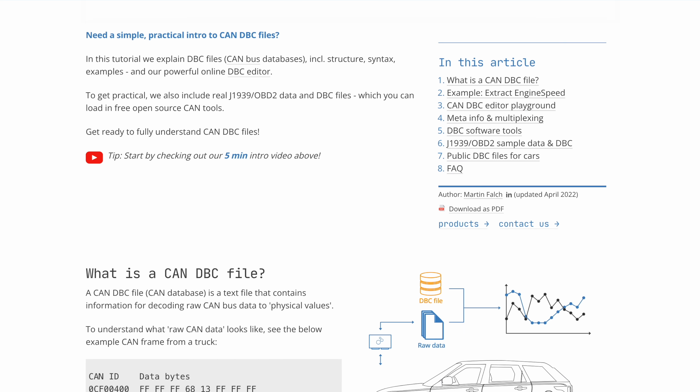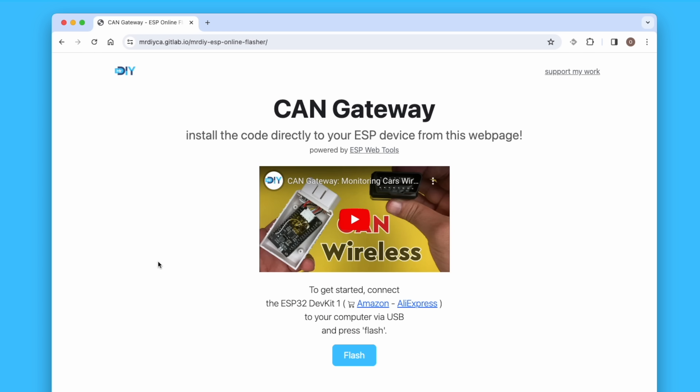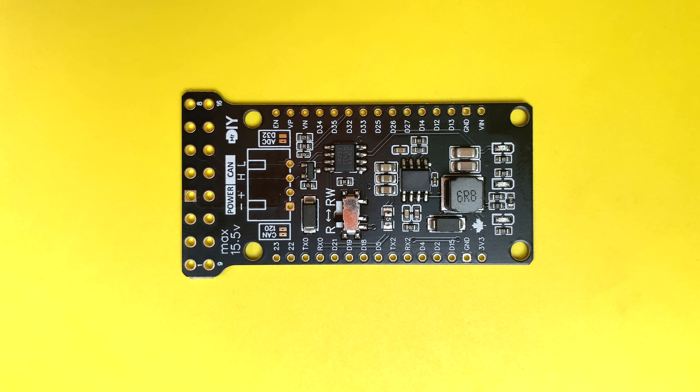If you are interested in trying out my project, here is what you'll need: an ESP32 dev kit, my CAN shield, an ESP32 display, some 3D-printed cases, and a few other components. To flash the ESP32 dev kit for the bridge or the ESP32 screen, simply visit my online flasher and load the code using your browser with just a few clicks. Everything is plug and play — no configuration or coding required. I highly recommend keeping the shield in read-only mode. While the bridge doesn't actually write anything to the car, having that extra layer of security provides peace of mind.